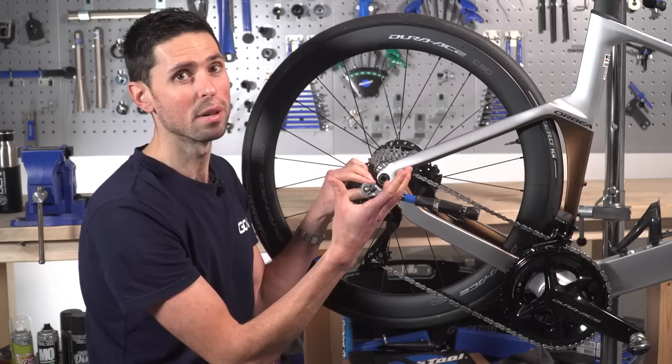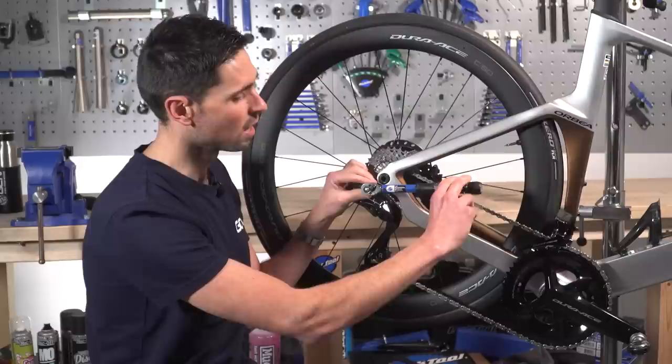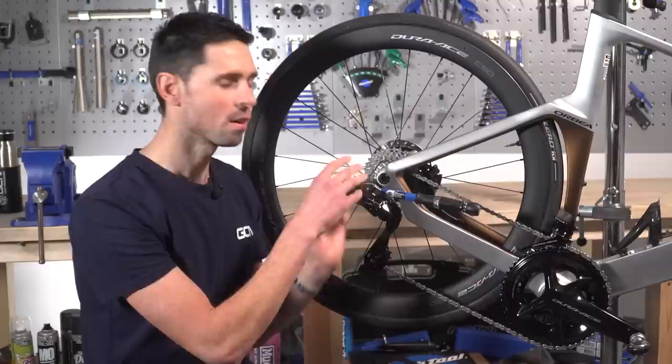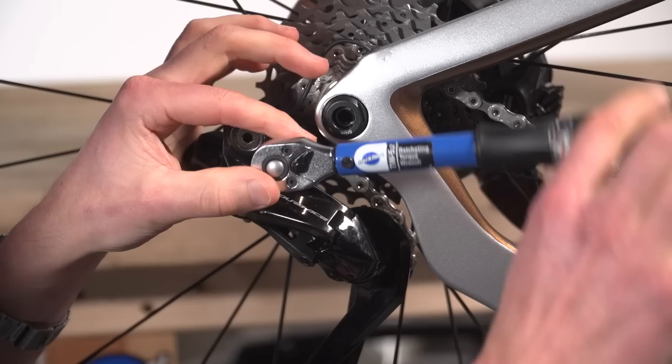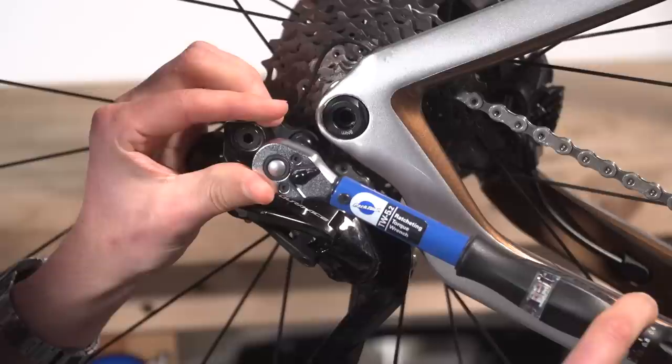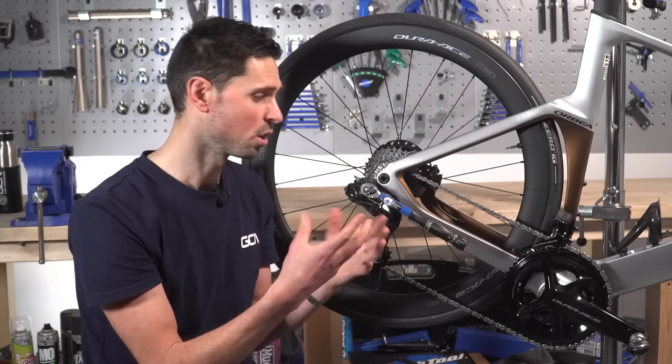I've already pre-lubed this, so I can just then start to tighten it up and gradually apply a little bit of force. Now, it's important to support the end of the torque wrench as you're doing this. When I say support it, I don't mean say it's doing a good job — like, 'good job, buddy, hang in there' — I mean just hold it so that there's no risk of the tool slipping. We can apply the force through the handle holding the end of the tool, and you can see that the torque wrench is clicking and that handle is moving. That's indicating that we've reached that torque limit that we've set the tool to and we don't need to go any tighter than that.